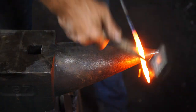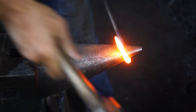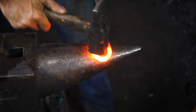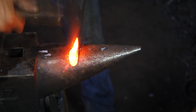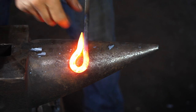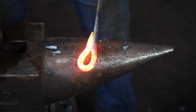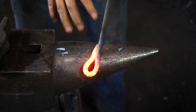Step two: about three inches off the horn, I'm just gently tapping this around the horn, bringing it back onto itself, creating an eye shape — and then about an inch of flatness against that piece. Because this is a round bar that we're working with, it's already convex, so we've got two convex surfaces meeting. This is really quite ideal as far as a welding surface.